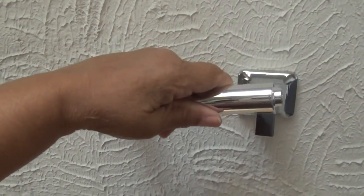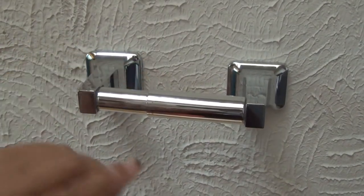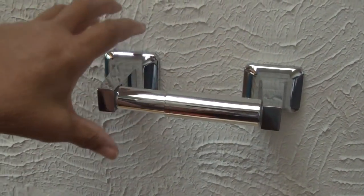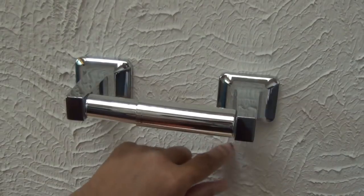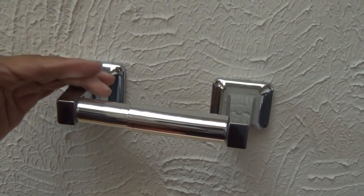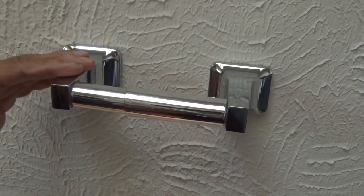This is going to last a good long time. This is a solid way to make the repair — pretty quick, 10 minutes tops. Whatever you do, don't drill two new holes and slide the toilet paper holder over, because then you're going to have two holes you have to patch and paint. This way all you have to do is drill a new larger hole, use a toggle bolt — you don't have to paint, you don't have to patch, and it's pretty quick.